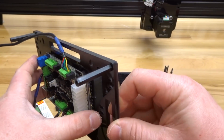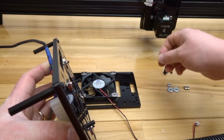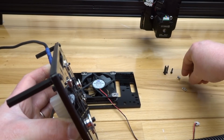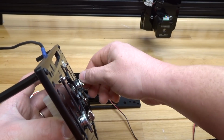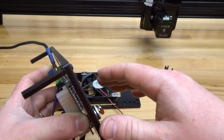So from the back end of the plate, we will then add our additional components. So starting with the 3mm aluminum spacer on each screw, followed by our slot washers. And next we will use the drop-in T-nuts. So just threading these on to the screws. And now this is ready to be tightened down to the V-slot. Now we're not going to do that yet.